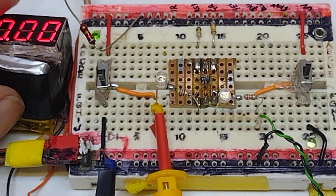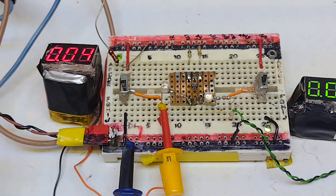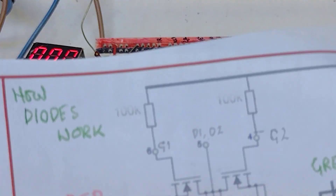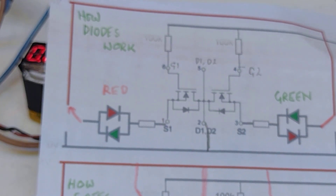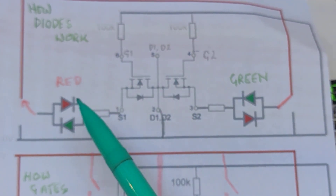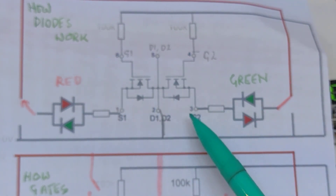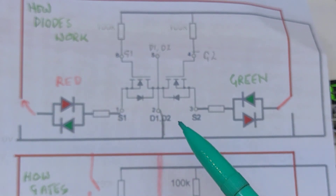So that's my board with my chip on it. How have I wired this up? Well, we need to have a look at the circuit. What I've got is my FETs in the middle - my dual FET chip. I've got red and green LEDs on the load on each source. These are bi-directional so I can tell which way the current's going.